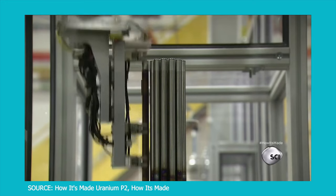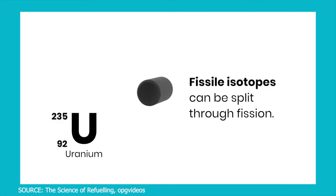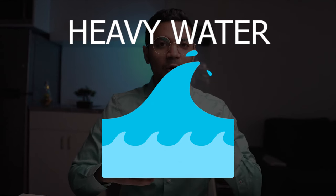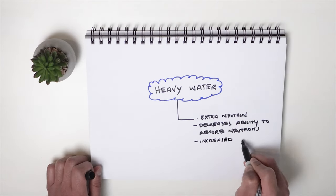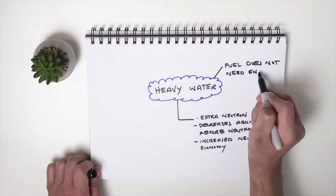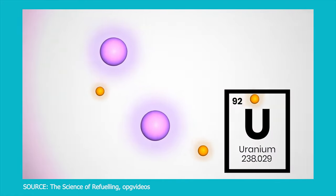CANDU is unique because it uses natural uranium instead of enriched uranium. What's the difference between the two? Uranium that exists in nature has an isotope called U-235, which is very scarce in nature. Coincidentally, this isotope is what actually does all the legwork when it comes to fission — it helps produce the fission reaction, which in turn produces heat. To mitigate the low U-235 content, CANDU uses heavy water instead of regular water. Heavy water has an extra neutron, which decreases its ability to absorb excess neutrons. Since heavy water doesn't absorb as many neutrons as regular water, it provides better neutron economy. And neutrons are what start the nuclear fission reaction — so better neutron economy means more power output, and you don't necessarily need enriched fuels.